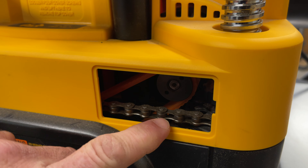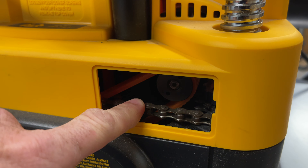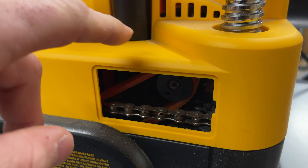If you use your included accessory, you can remove the access doors. This is a belt drive motor, and the carriage up and down is chain drive. Belt drive is good because if you overload the tool, at least there's a failure point before the motor.